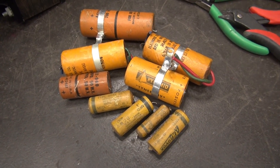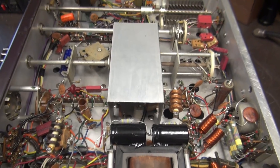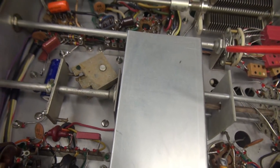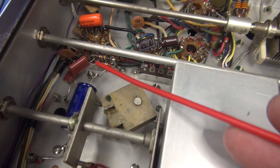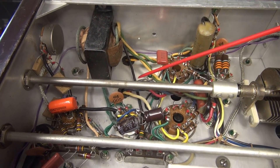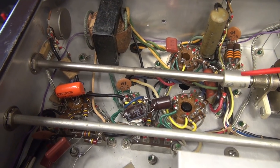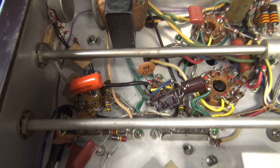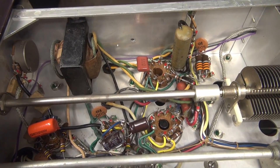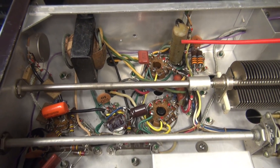There they are — the fallen capacitors. Served us well for over 50 years. Take a look at the bottom of the Ranger now — a lot of that clutter is gone. Here are my high voltage caps. Working over to the modulation section: the filter cap there, a couple 0.1s tucked down with a new ground lug. Just look how much room has opened up around the modulation section now that we don't have those gigantic old paper cigars in there. Audio section is cleaned up — got one Sprague 0.02 microfarad coupling cap, a couple little electrolytics. The only thing I still need to change is C69, which is a 1600-volt cap — that's the only paper cap left.